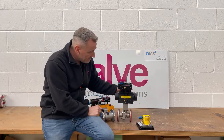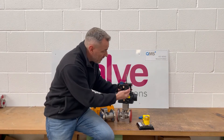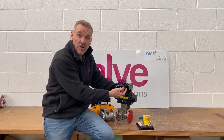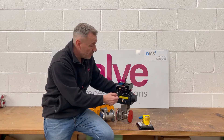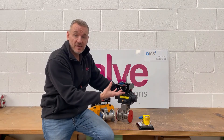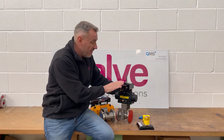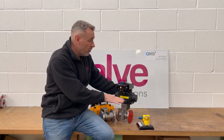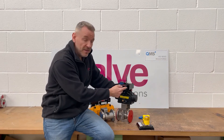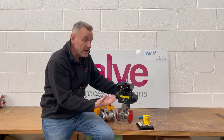It's a really neat solution compared to the standard back-wired solenoid. The other great thing about this solenoid is that it has a little telltale, which I've talked about before in one of our meet-the-product videos on the YouTube channel. If I go to site and the client energizes the valve with air and power, if I see the little red dot move in there but the valve doesn't open, I know the problem is below the switch box. If I don't see the red telltale move, I know it's probably something to do with the spool, the coil, or something controlling the switch box — so it's a really nice diagnostic feature.